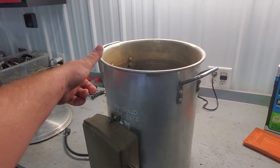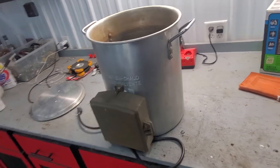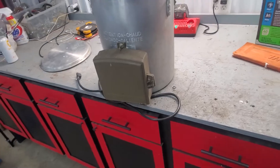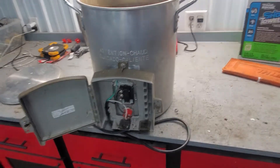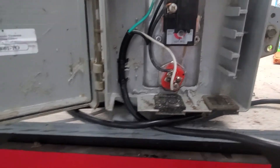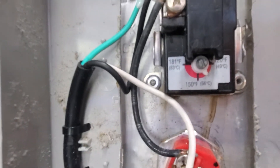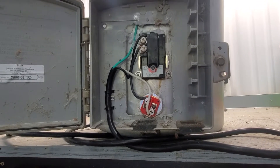So I went this route. In here I've got a hot water heater element — they're meant to screw into your hot water heater. It's threaded and you can see it down in there. That right there is a one-inch conduit nut for an electrical conduit. Inside you see the 120-volt, 1440-watt electric hot water heater element and a hot water thermostat. This particular Camco thermostat is commercial — it allows you to get the water temp up to 180 degrees.